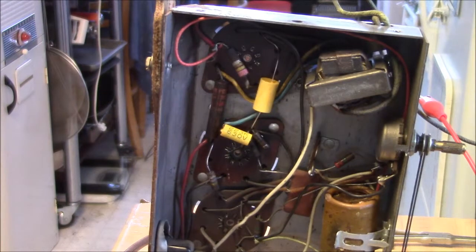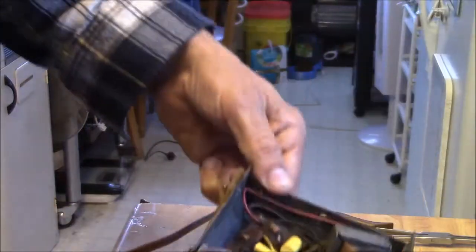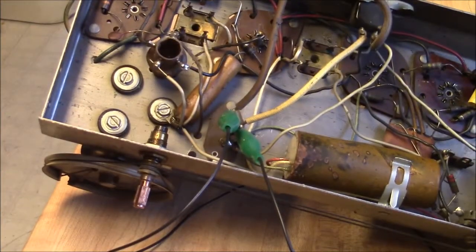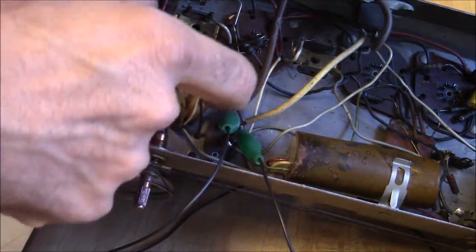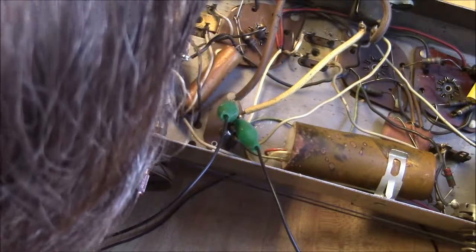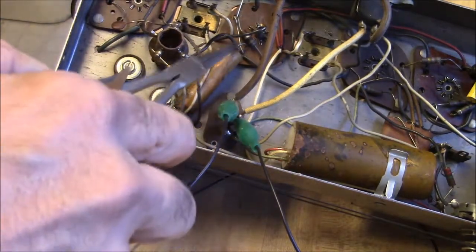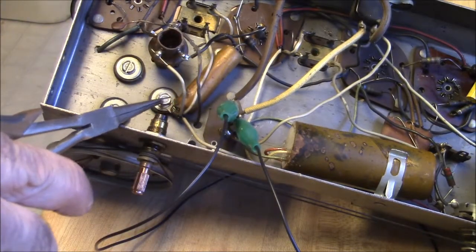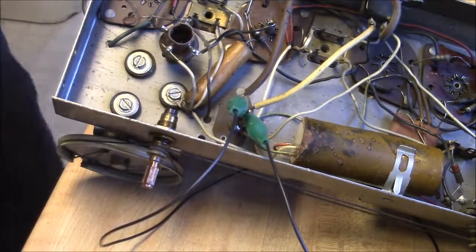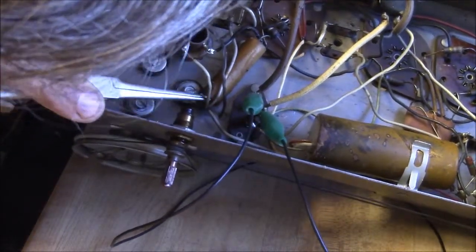Okay, dokie. So, in the scheme of things, we really only have one paper cap to replace. It's this one here. It's a little kludgy. This is kind of an irritant because this lead is just slid under that terminal board. There's actually a little eyelet here, and they've crimped that right up against. Well, no, maybe I take that back. Maybe they haven't. It looks like maybe they coiled that. Yeah, the wax is melted onto there. It's okay.